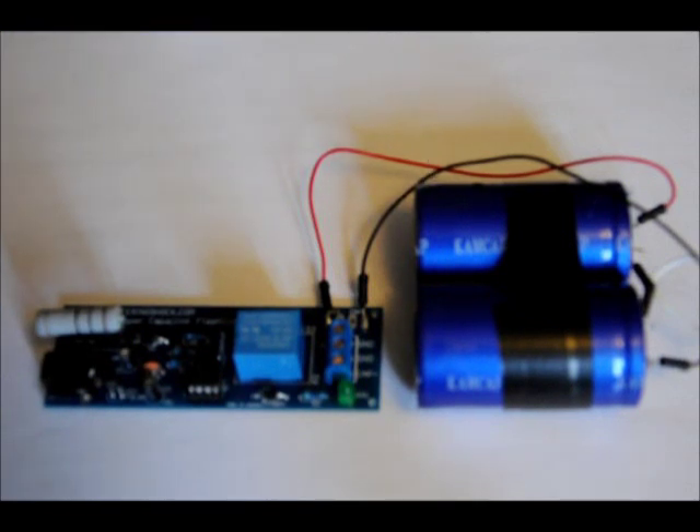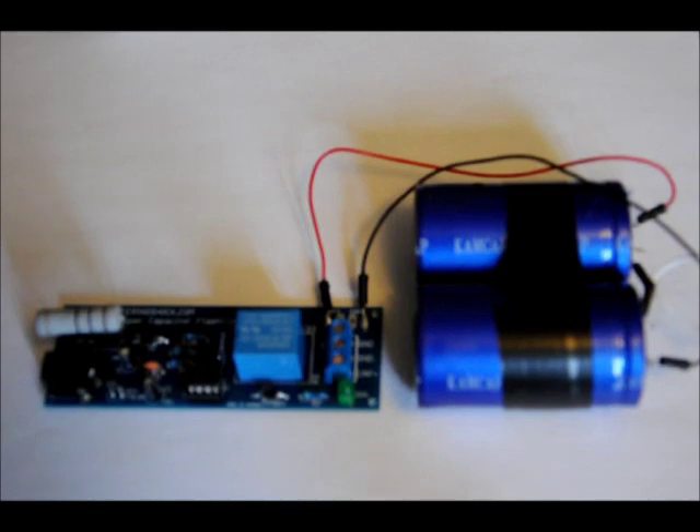These capacitors can be charged in their bank configuration up to 5.4V, but I'm not 100% sure that I want to put 5V on the power leads of the wireless controller. It does say on the back there's a 5V configuration, but I think that's for a battery adapter. So I'm going to be putting these on the actual leads. Two fully charged Duracell batteries in series could be anywhere from 3V to 3.7V — I tried this at 3.9V, no problem. But I don't want to fry anyone's controller, so I think about 3.75V is pretty good.